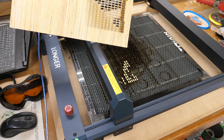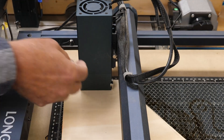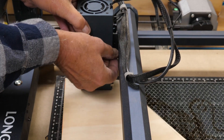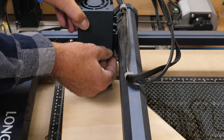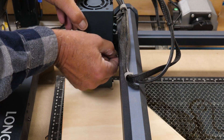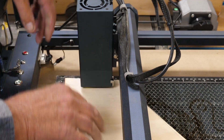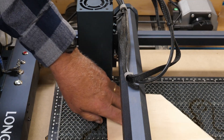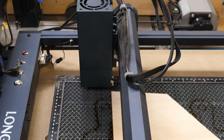Now let's amp it up a little bit. I'm going to put in something that's hard to cut — half inch plywood. In case you're new to one of these: to set the focus, loosen the thumb screw up here, raise the head, drop the little kickstand right there, put it down on the work, and tighten the thumb screw back up. Don't forget to put the kickstand back up because that'll mess you up if you don't. This is a piece of marine plywood, so it's going to be a little tough to cut.